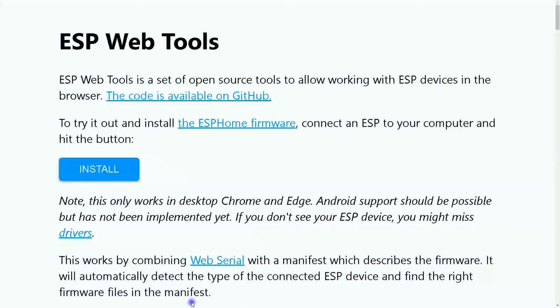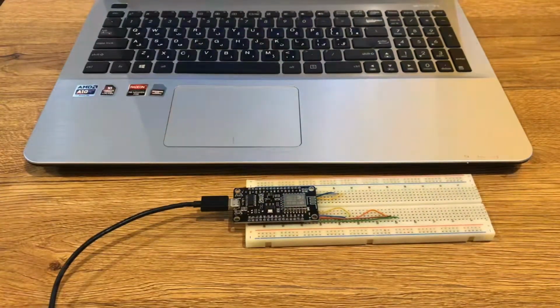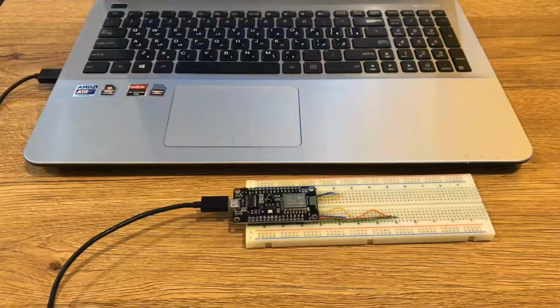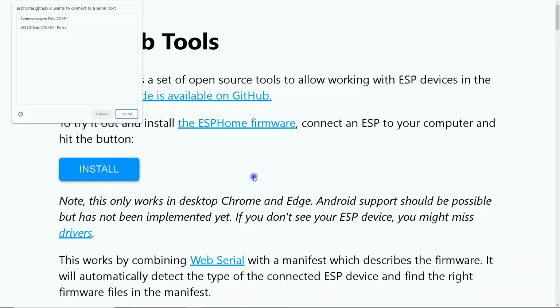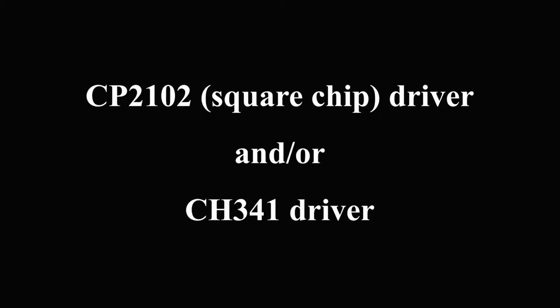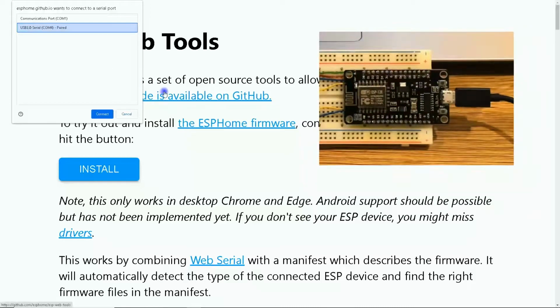Let's try it out. I navigate to the ESP Web Tools page, then connect my ESP8266 to the computer using a USB cable. After that, I select install. This is my device. If the serial port is not showing up, your computer needs drivers for the USB serial chip used in your ESP device. In the description, you can find links of 2 drivers that work for most ESP devices. Okay, I selected the device, then I click on connect.